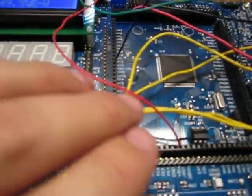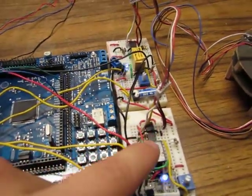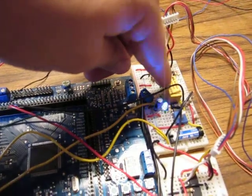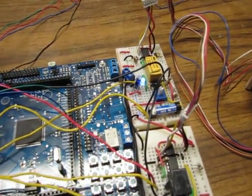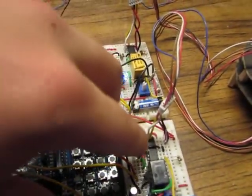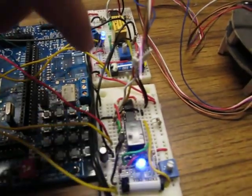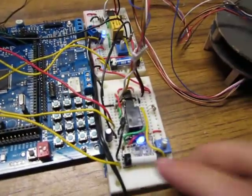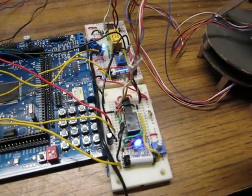Following port B out through the yellow wires we got the north and south and east and west tracker. When the first relay opens up it introduces the stepping function from the 555 timer to the MC3479. That introduces the stepping motion to the circuit. And for direction we have another relay at the bottom of each one — when that's open it will rotate the other way.